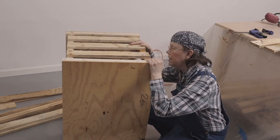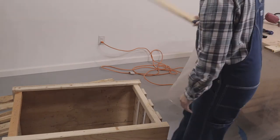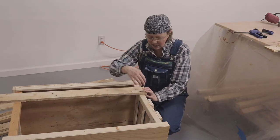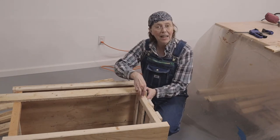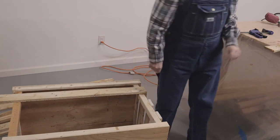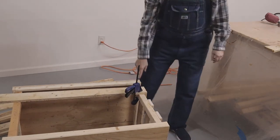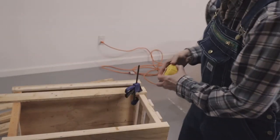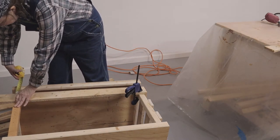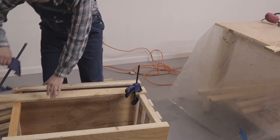If you want it to look decent — of course you don't have to — here's the trick. I'm going to turn this over, and here's our side piece. What I've decided to do here is match and overlap what's on the back. Now it's actually not going to be attached to that board back there — it's going to be attached to the 2x2 — but I want it to be dead even across there. So I'm going to clamp that in place and take a measurement to see how far it is. It should be two inches. Yep, two inches. And then I'm going to look for two inches over here to make sure I'm fairly square on that, and then clamp that one into place too.